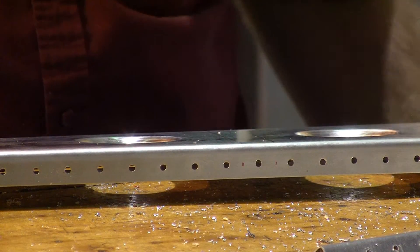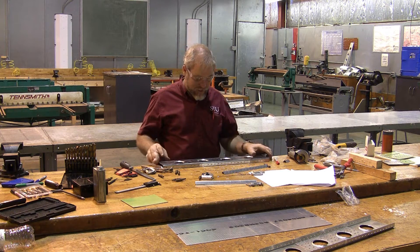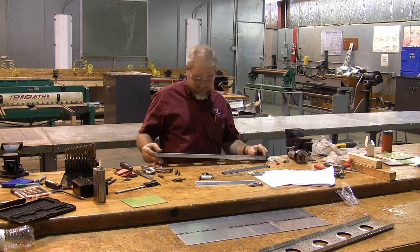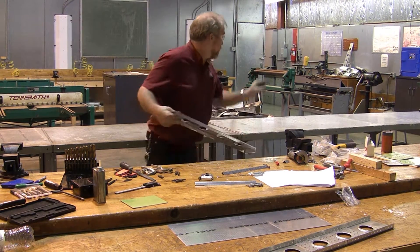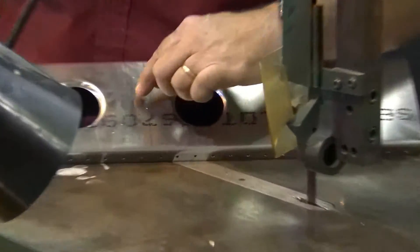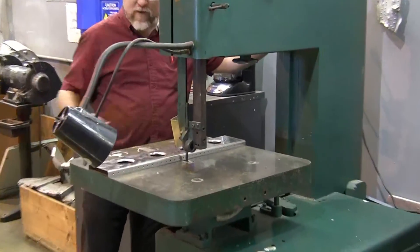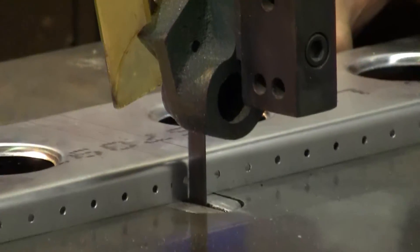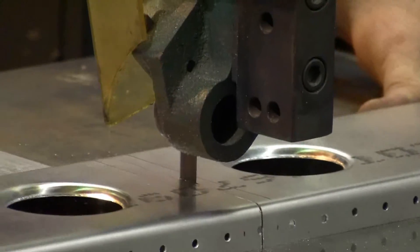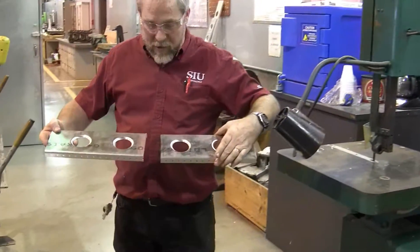And that is where my cutting is going to occur. Now there are some easier ways to do this cutting and some harder ways, and I'm going to show you the easier way. Any way you can do it where you don't damage the spar is not incorrect. We're going to use the bandsaw. On our bandsaw cut, we're going to run right up the center — not on either of these red lines, because the bandsaw tears and leaves jagged edges. Also, warn yourself that this bandsaw is going to be loud; you might want to wear hearing protection. Keep your fingers away from the bandsaw as well.